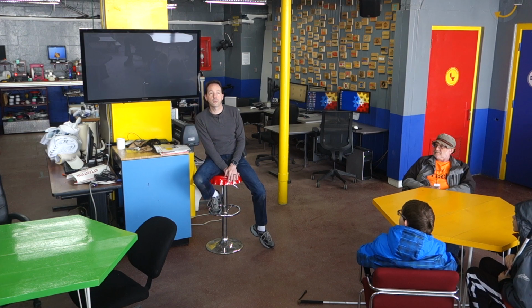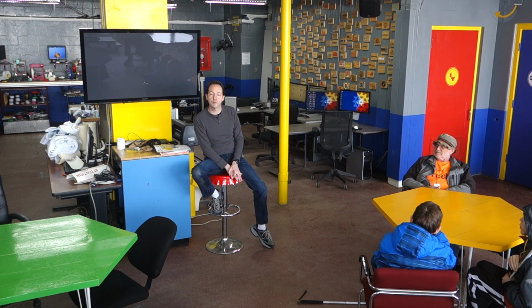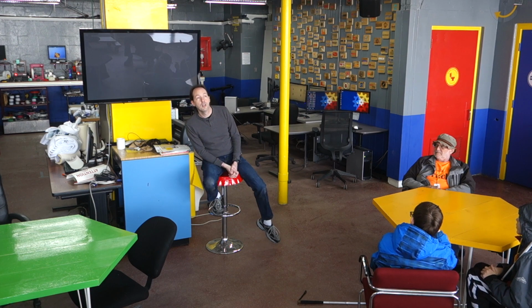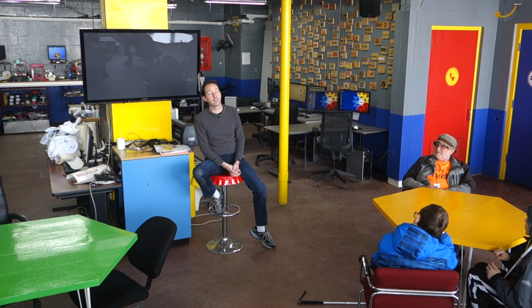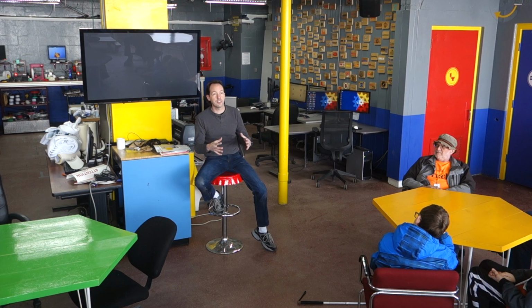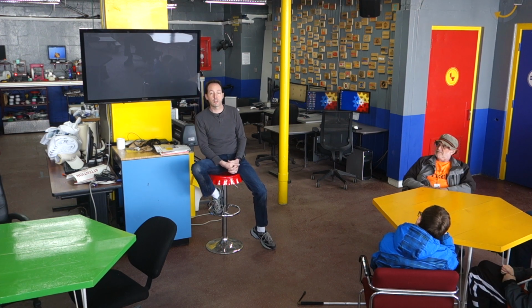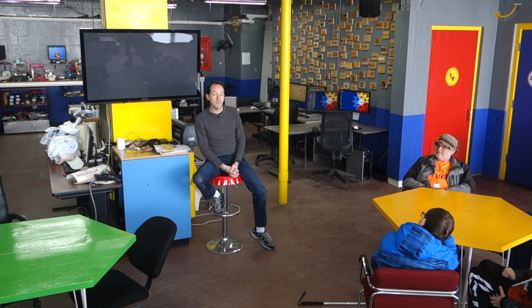A Tesla coil is a radio frequency air core resonant transformer system that is used to take an input voltage that could be AC or DC, depending on how you're doing it, drive it into a tank circuit through an RLC setup, use that to power a primary system, and that primary system drives a secondary, sometimes a tertiary coil, into a state of resonance. Can you repeat it in non-electrical terms? It's an electrical swing set.